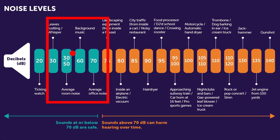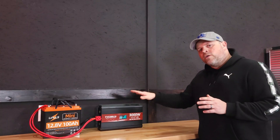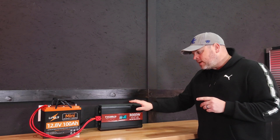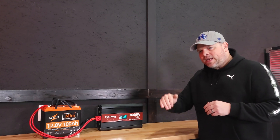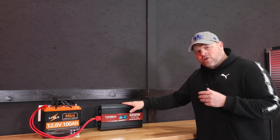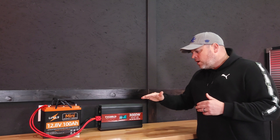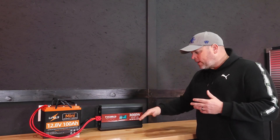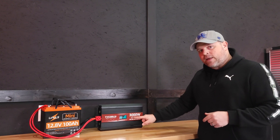Although it was running at 55 decibels, it was a little louder than I'd like, but most of these power inverters run over 60 decibels and we're lucky to see anything in the 40s. So this is on average the same noise level you'd expect from any inverter of this size. Overall, this is one of the best inverters I've tested, especially at 3,000 watts — it didn't cause the heat guns to fluctuate in power the way you sometimes hear with other inverters struggling to keep up. The cooling fans kicked on immediately at load and kept the unit cool throughout.